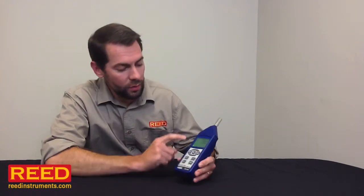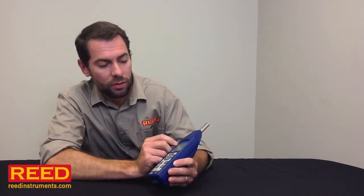Let's start logging. We have that all set up. All you have to do is hit the record button — you see record come up here on the top. Then to start recording, you hit the logger button. You'll see it start flashing — that means you're reading. If you need to pause or if you're ready to stop, hit the logger button first and you'll see that record stops flashing. Before you take the card out, hold the record button down for about two seconds until you see the icon disappear at the top. Now you're ready to take your SD card out and download your results.